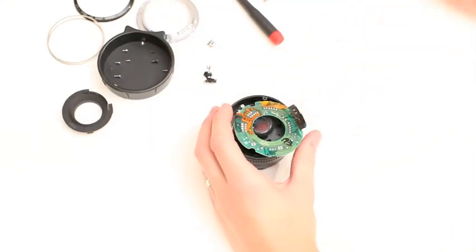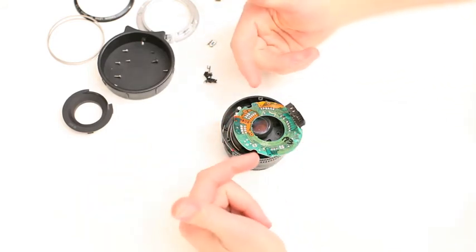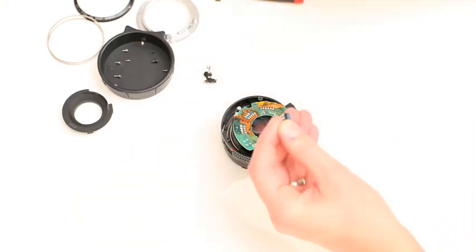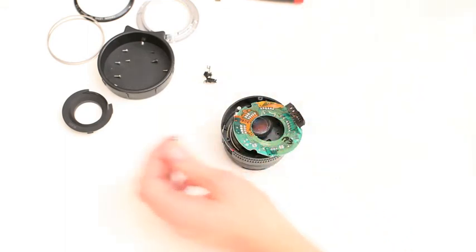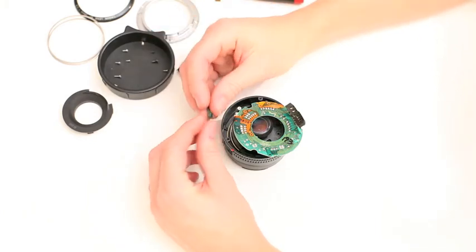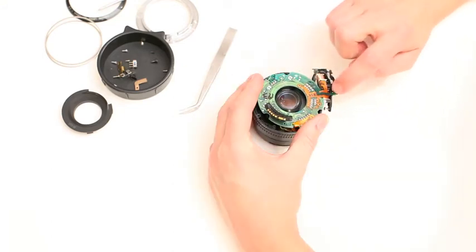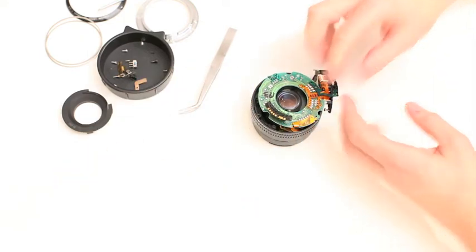I hooked the tabs up to a camera and it totally thinks it's in manual focus — so it's good. It's okay that we just take this out. With the 50mm I was going to switch it over to manual and glue it, but the camera thinks it's in manual anyway, so it doesn't need a focus lock or settings change — it just takes photos. My goal is to get this whole autofocus assembly off. I'm going to start with this green ribbon, check the camera, make sure it works, then take off this orange ribbon, and keep checking as long as everything works — then hopefully remove the entire assembly.